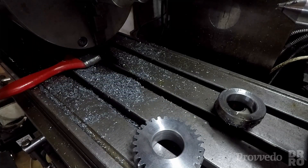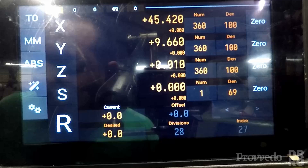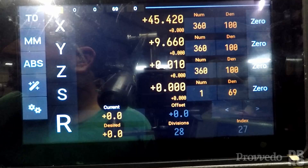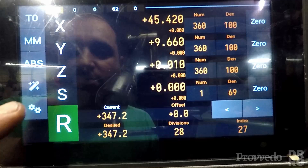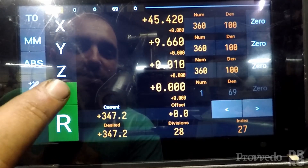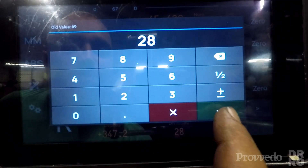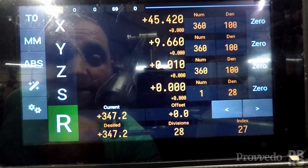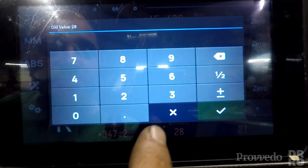The next one I think we'll try gear hobbing. One thing we need for gear hobbing is to synchronize the dividing head to the spindle — that's usually a bit complicated, but with the help of the DRO we can synchronize with a gear ratio. In this case we go to 28 to 1, as it's a 28-tooth gear. We'll just give it a go and see what happens.